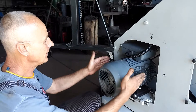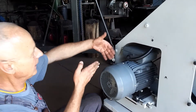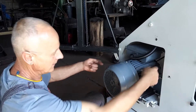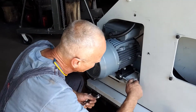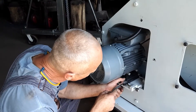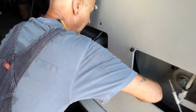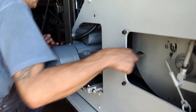The belt is trying to pull the motor in one direction, so the bolts that will actually do anything for sliding are this one and this diagonal one. First step is to loosen this one and move it out of the way, then loosen the four motor bolts. You may have to reach in — this is why it's important to have the motor positively shut off. Just loosen them a little bit, not too much.